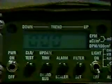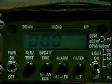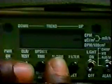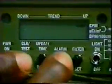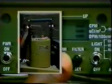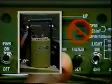The change is indicated by the displayed arrows. There are three arrows. Only the top two arrows are displayed with the beta gamma probe. For the alpha probe, the operator can change selection to any one of the three display arrows. For the x-ray probe, the connection will display only one of the two top arrows, either of which can be selected by the operator. Note: an incorrect arrow display indicates the radiac meter is malfunctioning and should be turned in for maintenance.